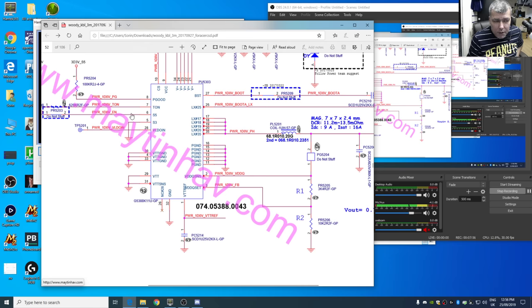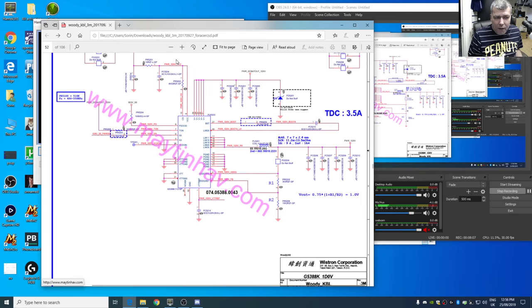It has a few input pins for the states, S3, S5. It's to check what? Everything is fine there. I check the input. On this one, the voltage is very low. So the voltage is getting lost here on the resistor. So I suppose this chip is gone. So what we will do, we'll replace the chip.